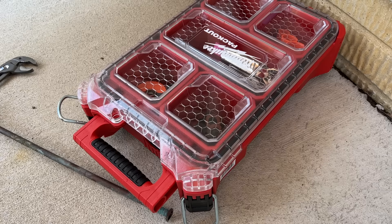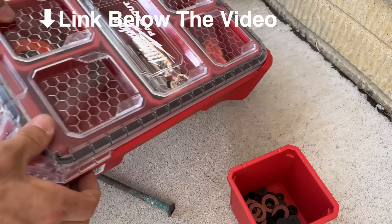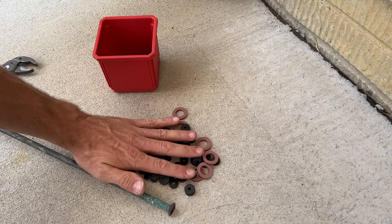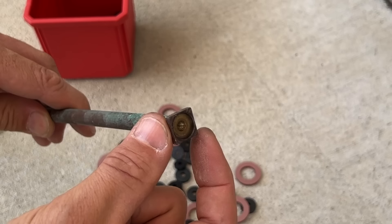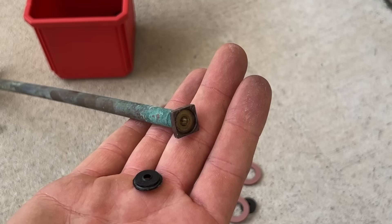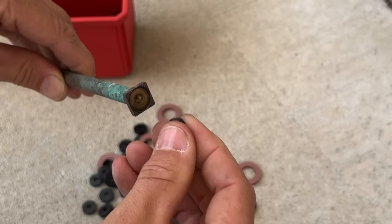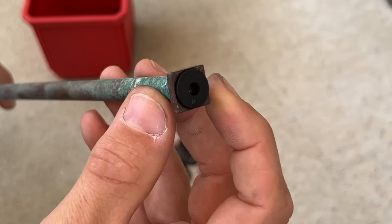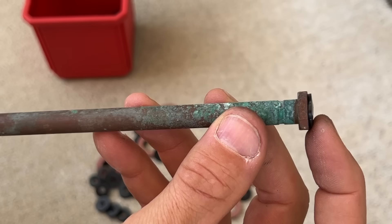Now we need to size up a flat washer to serve as our replacement. I got a pack of 10 different sizes of flat washers and I just keep that with me — it has yet to not solve my issue. Looking at the original one, it has a little bit of a lip on it, which actually shows it was probably missized originally, so I'm going to get a flat washer that actually fits within this groove. If you don't get the assortment pack — there's a link in the description for five or ten bucks, which is a no-brainer if you're doing maintenance around the house — take your stem and old flat washer to the hardware store to make sure you get the right size. This one should work: we have that rubber flat surface that will press against the seat of the valve body and give us a nice tight seal to solve our problem.